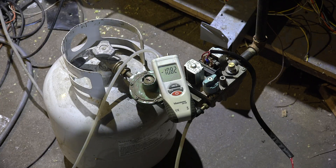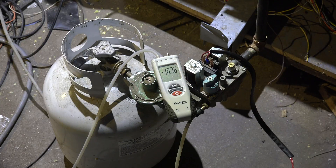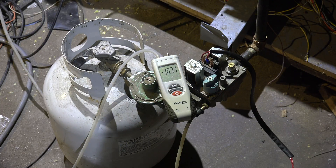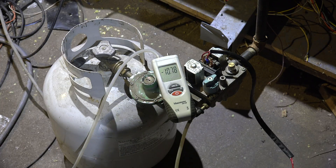What you don't ever want to do is put this valve directly up to the propane cylinder — it'll blow the diaphragms in it and gas will flow everywhere. Important safety tip: use two regulators. The original propane regulator drops the high pressure down to 11 inches of water column, then I'm going to take that 11 inches and drop it down further for this burner.